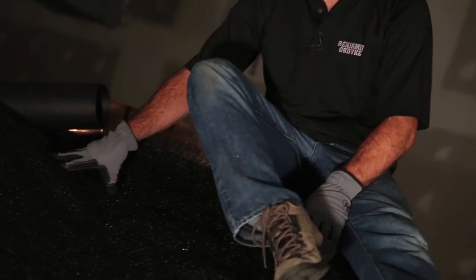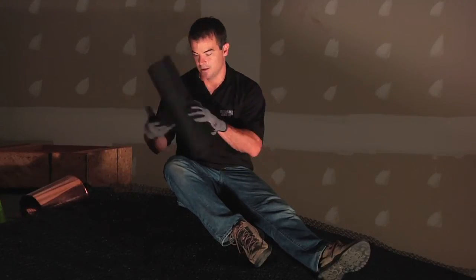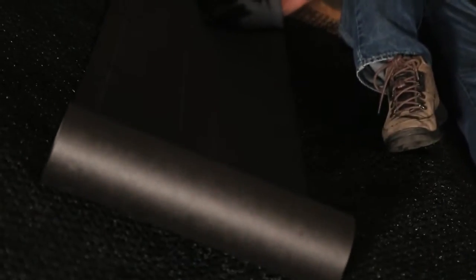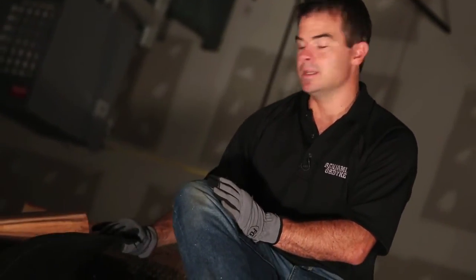Now that we've got the Cedar Breather down on top of the roof deck, I want to pay special attention to the valley location. We've got a protective membrane directly on top of the deck at the valley, we've got roofing felt, and we've got our Cedar Breather. What's different about this approach is the sequencing. Once the Cedar Breather is down into the valley, we're ready for a protective layer of felt — we recommend an 18-inch wide strip of felt over top of the Cedar Breather. Then over top of that, you install valley flashing. Once the valley flashing is installed, you're ready for your Cedar Shingles. Make sure the valley flashing is in direct contact with the cedar and doesn't allow any water entry into the Cedar Breather at this location.